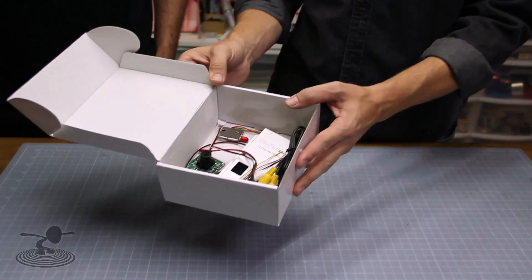For your first FPV setup, get everything in one: your camera, your receiver, your transmitter, and the wire loom that's already pre-soldered for you. Hobby King has a great affordable setup. The reason being is cameras are different voltages — some cameras 12 volts, some cameras 5 volts. If you start piecing everything out, there's a possibility you're going to have to make your own wire harness and may get the voltages wrong. It's better to start with something you know will work.